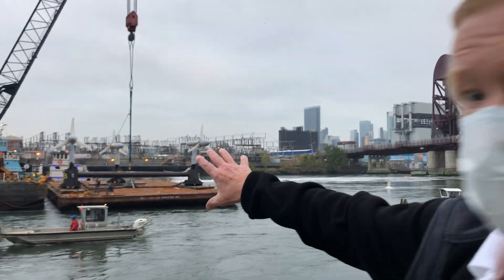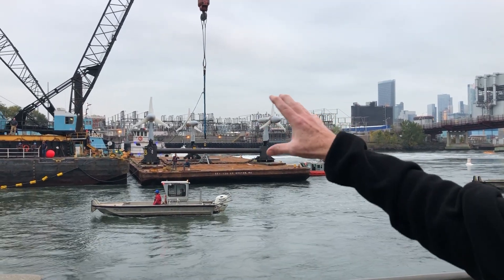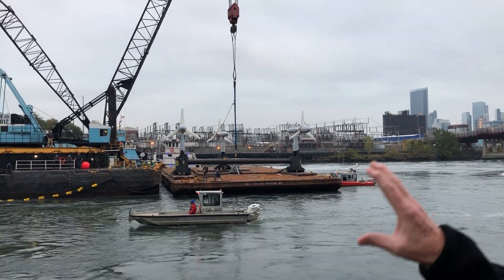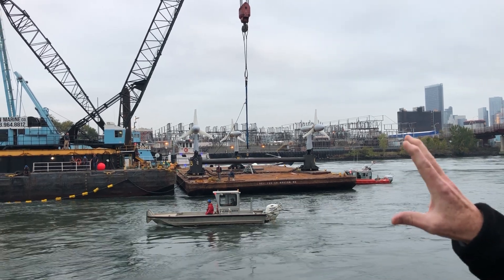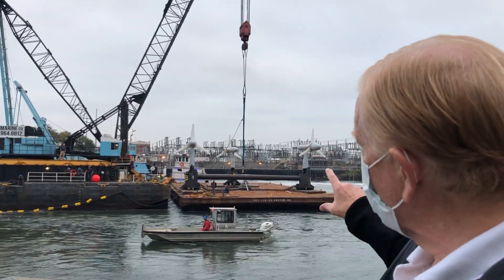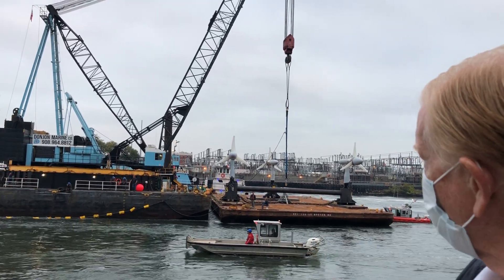What's going to happen tonight — and I'll get a little bit into what's happened preceding tonight. What we're doing tonight is we have a tri-frame right here. It's a three-sided foundation on which we have three separate turbines. The objective is to reduce the amount of time that we are working on water, because on-water work is a very high part of the cost of installing hydrokinetic power. The idea here is that we put in three turbines simultaneously, and that reduces the on-water work considerably.